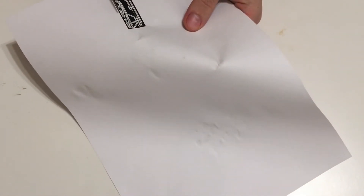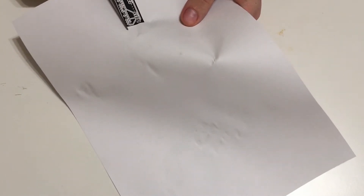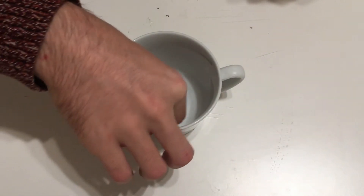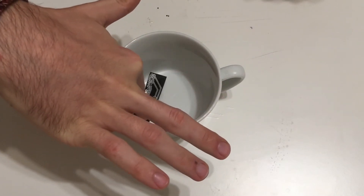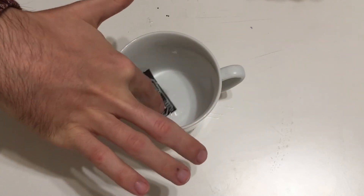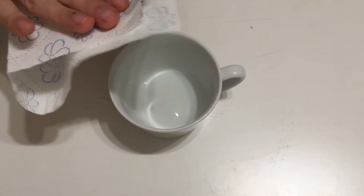Once we have the board cut to the desired size, we are going to print the circuit layout on a piece of paper. It can be done either using a laser printer or an inkjet printer, and then we are going to cut the paper to the desired size. Once the paper is cut we are going to soak it in cooking oil — I am using sunflower oil. This is because we want to make the paper more or less transparent to UV light, otherwise we won't get such good results. There are actually pre-made sprays that make the paper transparent, but they are quite expensive and this method works quite well.